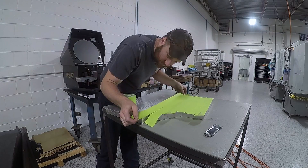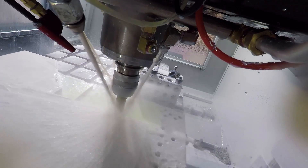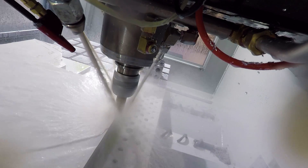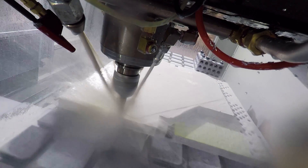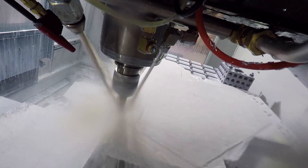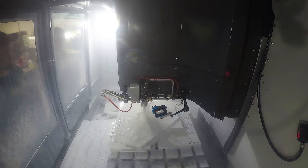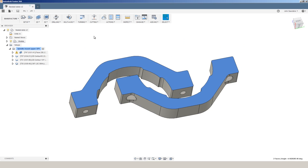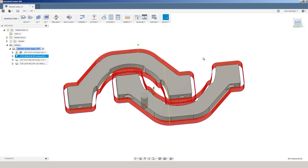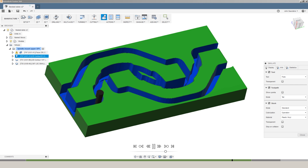The other reason is we've become huge fans of the super glue technique. Slotting combined with the super glue technique is great for a couple of reasons. Number one, it has the potential to spend less time in the cut, which means we can help avoid heating up our part. Heat is what tends to break the bond either between the super glue and the tape or the tape and the part. Now that's not a free lunch because slotting can also generate more heat sometimes because of the nature of that cut. And finally, you can get more parts out of your material — sometimes you want to nest two parts that are mirrored or offset from each other, or just lay down a strip of material and bang out four parts really quick.